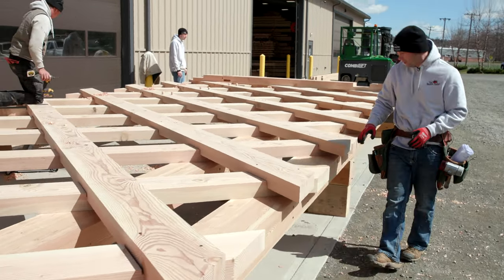This bridge is all about the joinery. There's actually more joints in this bridge than there are timbers. Think about that, that is pretty crazy. And we went to great lengths to ensure this was an authentic 1800s era bridge. All peg connections, step lap joinery, mortise and tenon connections, full housings. There is not a detail missed on this barnyard bridge.